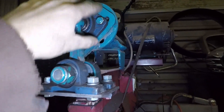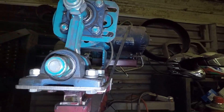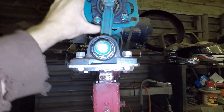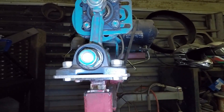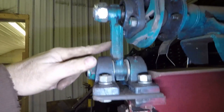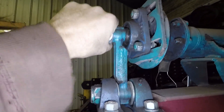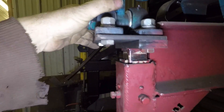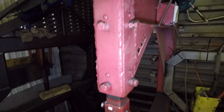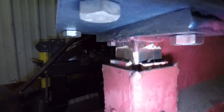I made a slide so you can variable the throw — like how much this swings. I can move this out to get more swing if I need. This is just two connecting rods — I just welded them together. They just happened to be the right size that the bolt I had fit through with my two pillow bearings. More scrap. It's just a solid chunk of steel. This isn't even square pipe — I welded these flat plates because that was all that made sense to me.